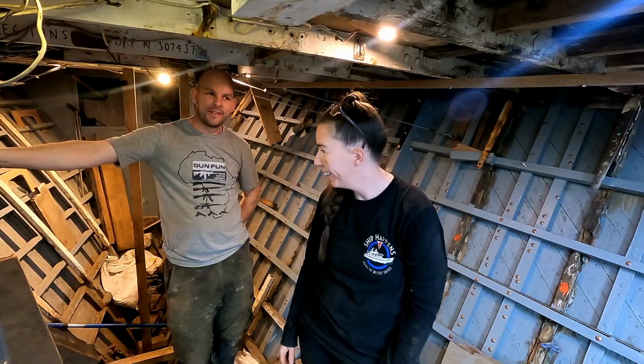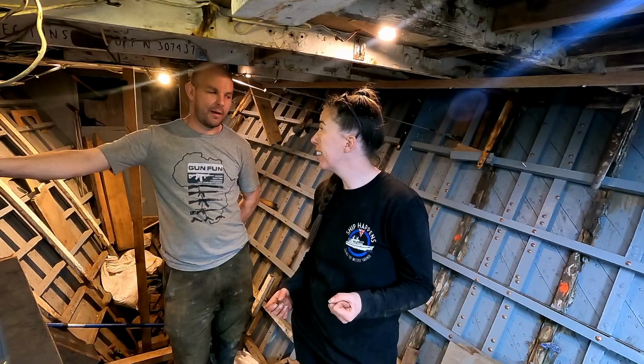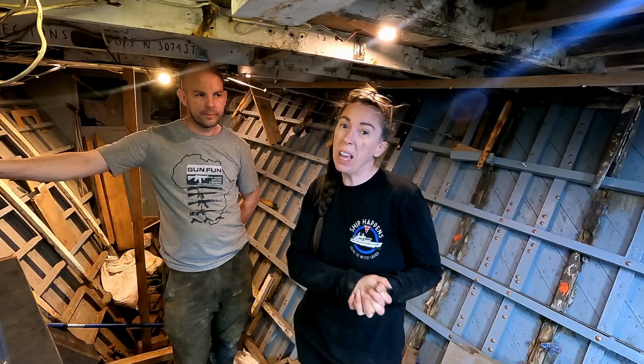So that was a tough day. We accomplished something that we didn't think we were going to have to accomplish, didn't we? It was like opening a can of worms today. Yeah, it is what it is. So we got a frame in, we got a sister on the frame also, we got a stringer sister in and a little fix. A noggin on a stringer. So we haven't had time to do the web frame, unfortunately. No. But we can do that next time.